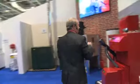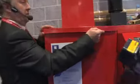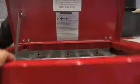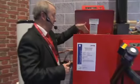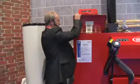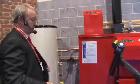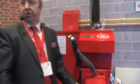And then if we go across into the hopper side, you see the cyclone is slowly filling up. Can you get in there, Helen? Well done. Once the cyclone finishes, what he'll do, he'll then nip the pellets into the hopper. What we've then got, it then feeds from that internal hopper into the burner side of it.